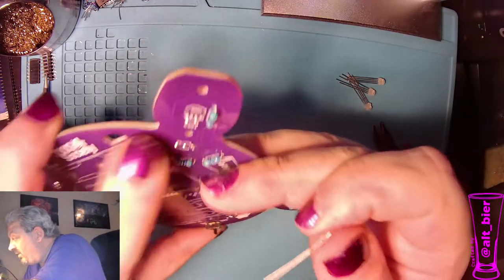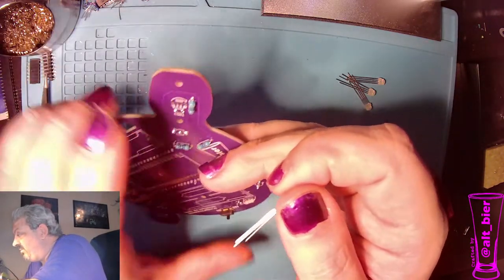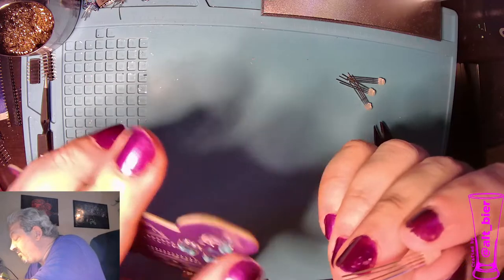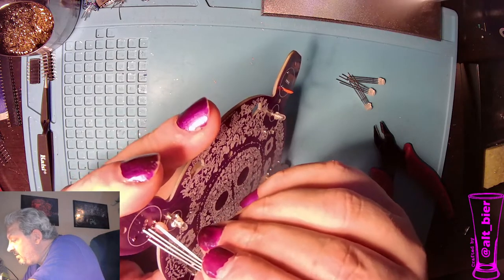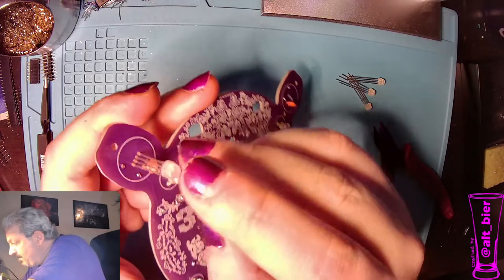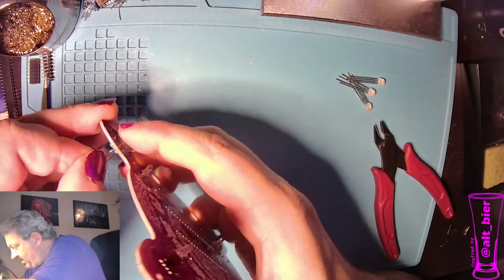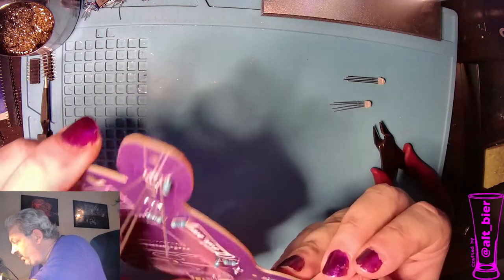And then on the board itself, you'll see that I have it aligned to where the flat side's going in the same direction as the other LED, always to the right on the back, or to the left on the front. And so let us get this in place. And push it down all the way. Bend a couple of pins out. And that looks good. And we'll do that the rest of the times around the wheel.